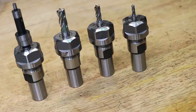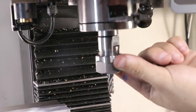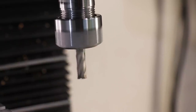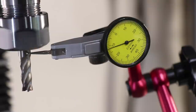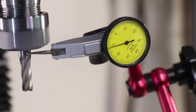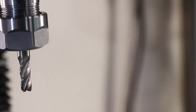Let's go and see if it actually works. Off the bat it fits together really nicely, which is a good sign. Looking at it by eye I couldn't see any runout, which is a really good sign. Looking at the test indicator, that looks to be about 0.01 millimetres of runout. Keep in mind that this end mill is held in a collet and that holder is held in another collet — that's a lot of potential sources of runout. Overall that is really impressive.